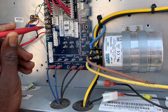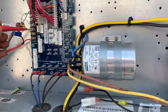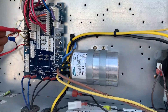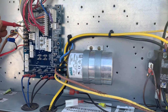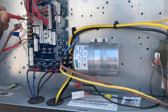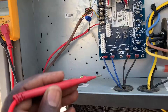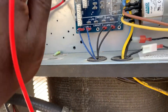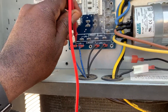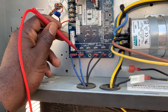No short to red. I'm getting a short to yellow. Nothing on Y2, nothing on W1. I got a short on W2. No short on the blower. These are my low pressure switch, that's my high pressure switch — gonna connect here and here. My meter's beeping.